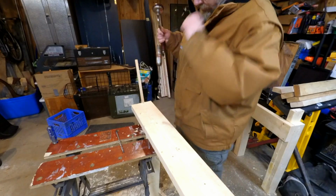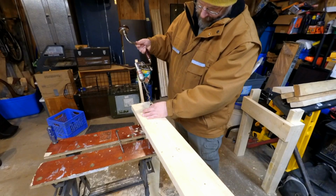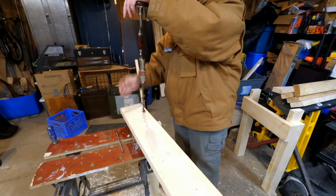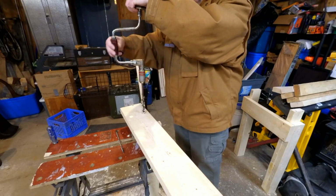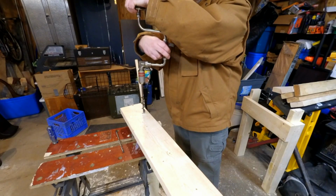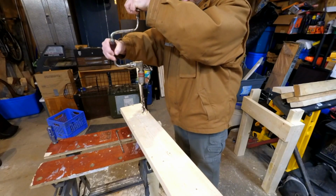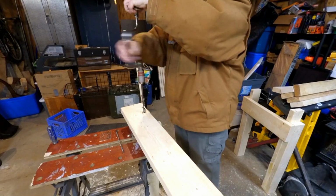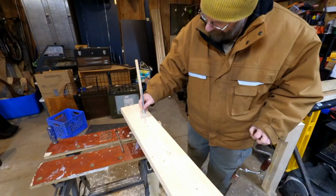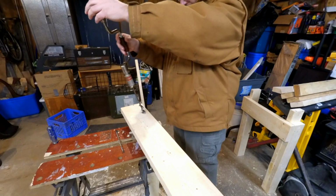It's silent, it's easy to control, and it's actually a lot faster, a lot more efficient than you might think. Like this, wait for it to get into the cutting bits. Starting to score the wood fibers there now. I'm just going to try it. 1, 2, 3, 4. Unscrew. That might be a little shallow. I might want the 5th one. Yeah, I'll give it just another little turn, I think it wants about 4.5 or 5 turns.